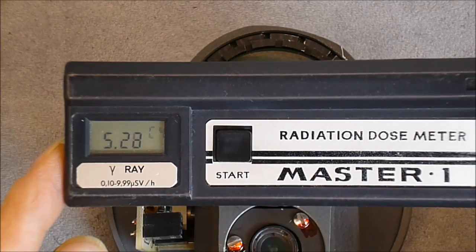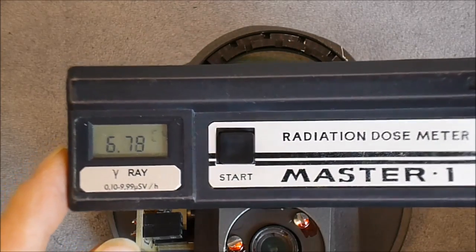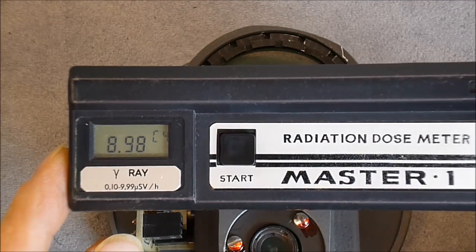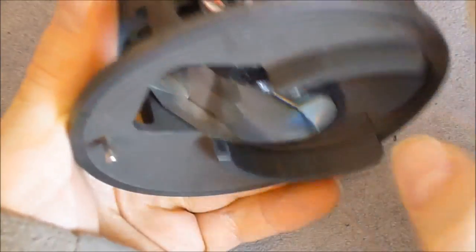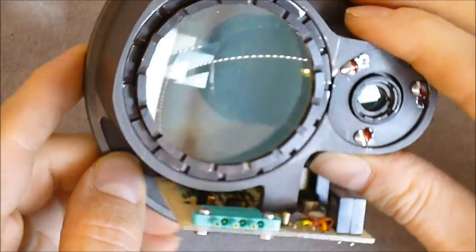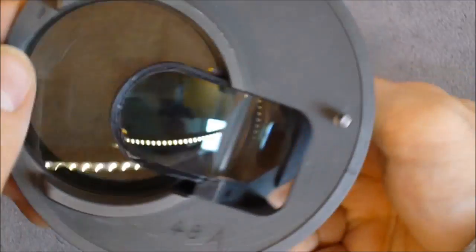Lots of vintage commercial optics have a thorium lens inside. I think mostly Minolta optics, Minolta MD optics, all the Japanese optics from the 60s, 70s. Yes, 9 microsieverts. This must be some fine adjustment for the prism position, probably. And everything is in a die-cast aluminium structural piece. We can see here the back side of the prism, front side.